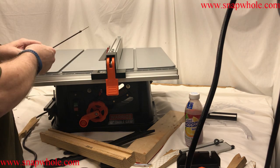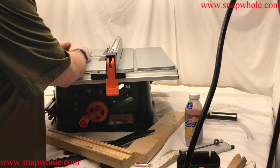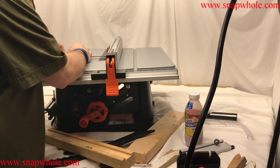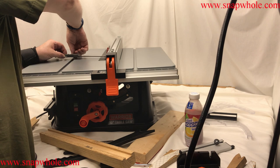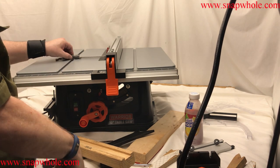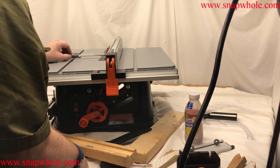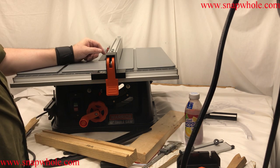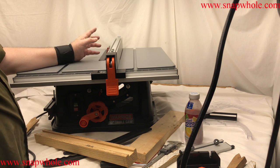So I took off the tool fence. I'm going to measure that. I do this on my big saw too. I make sure I measure it here to make sure my distance is right and I make adjustments if I need to. It's hard to do this and get the back of the tooth because I had a smaller caliper. So there's the front. Is the back the same? If there is any play in that, I'm not seeing it. The difference between the two is in the hundredths of a millimeter. So I consider that pretty good for this saw.